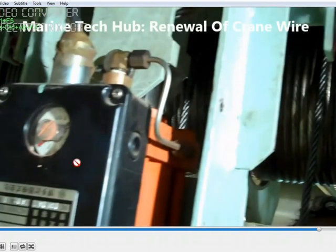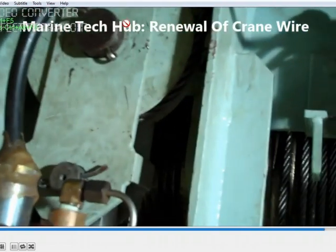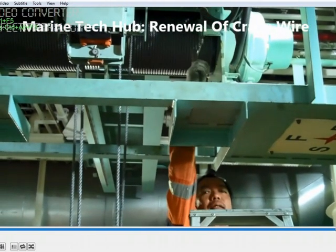The whole cable comes through this pulley. When you have more than four turns on the drum, the pulley will give an electrical signal that will trip the crane — this is the overload mechanism. When the wire is pulled up, the hook attached to the mechanism will trigger the overload trip. You can see the cable going into two slots attached to this arrangement.